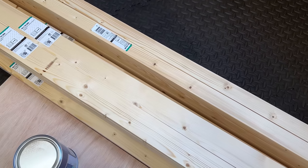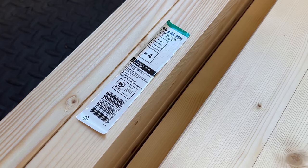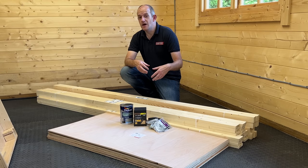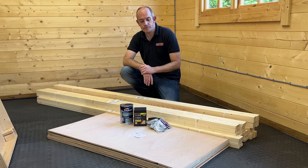I've then got a pile of 44mm square timber as well. I'm going to use that to make a set of legs to go underneath each board. So there won't be 2 legs per board, there'll be 2 legs on selected boards to give them the strength, and then the other ones will piggyback off the back of that with 1 leg on each board after that.